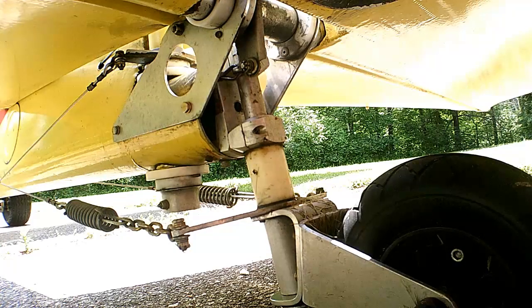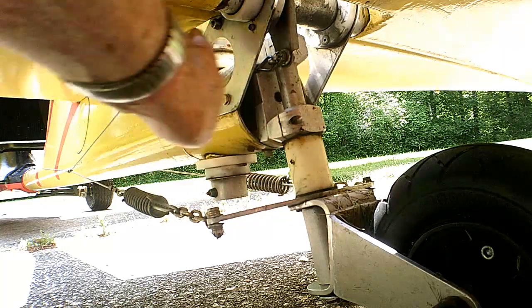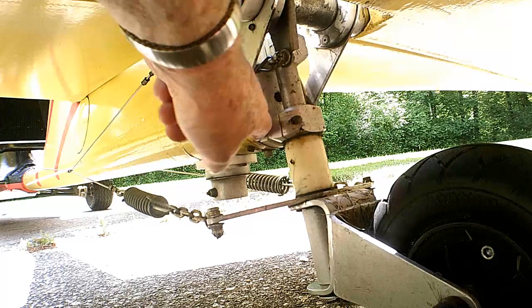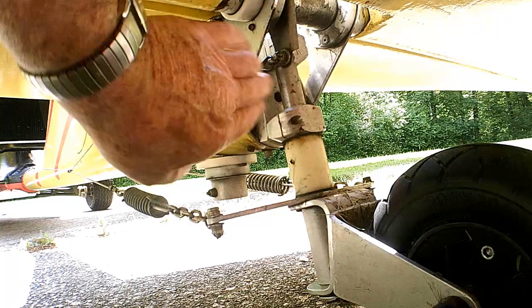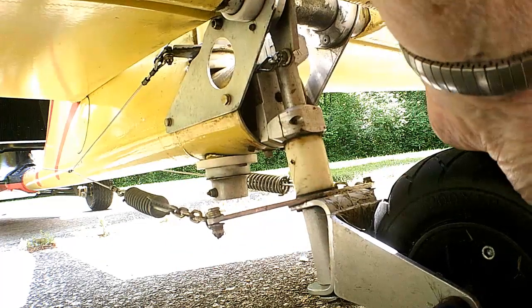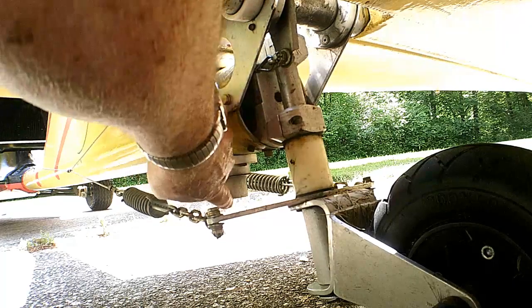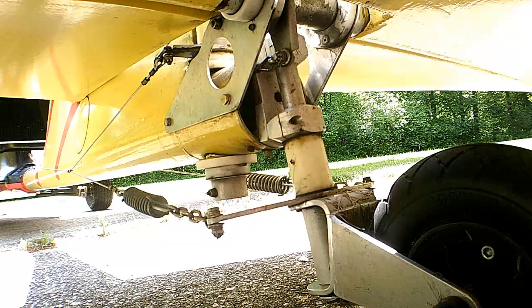It would have made the back end drag even lower, and it was jacked up enough in the front end as it was. This piece here is just a block of aluminum that I machined at an angle so it slopes backward, and I turned it to this diameter here, which I think is about a 4-inch tube, but it fits inside there. You'll see a screw right here that holds it on, and that puts this shaft at a proper caster angle so that this wheel wants to self-steer and go straight rather than crooked. With what ASAP sent you, it was hooked on the bottom of this, which is the end of the rudder right here, and that was sloping the wrong direction, and of course it made the thing inherently unstable. It wanted to go everywhere but straight.